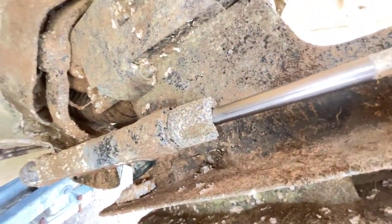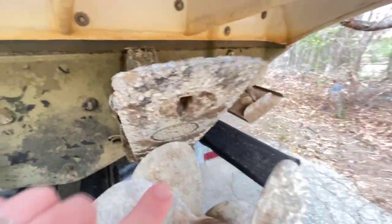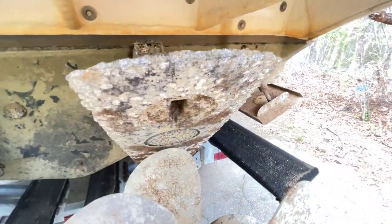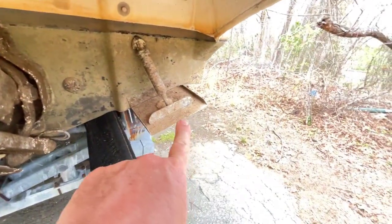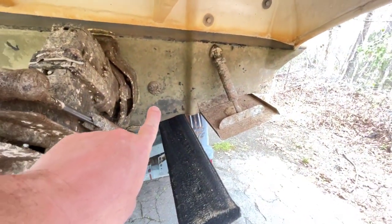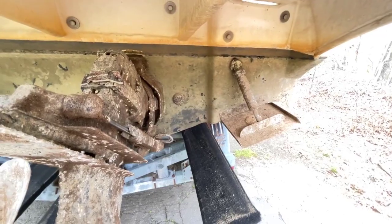And if you're going to leave your stern drive in the water, what's protecting it partly are these anodes. You've got usually a set there on the trim tabs, there's usually a setup underneath, you might have one on the hub, you've got a couple here on a Bravo 3 drive, and you'll probably have some on the trim tabs. This boat also has a mercathode, which helps to avoid the electrolysis issue.